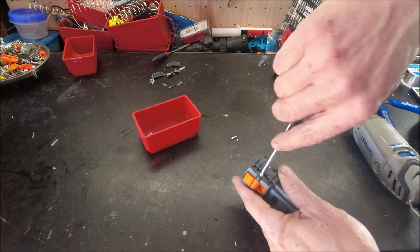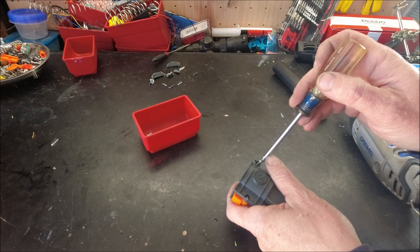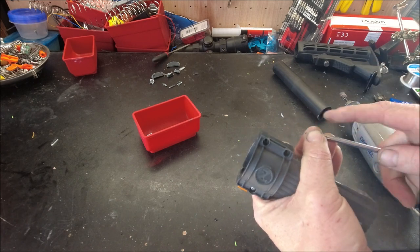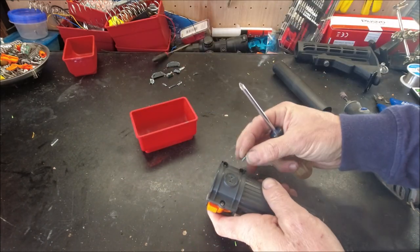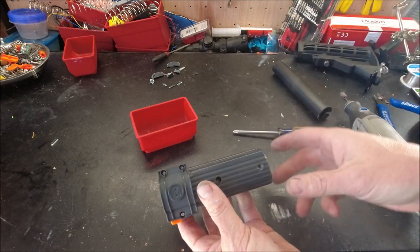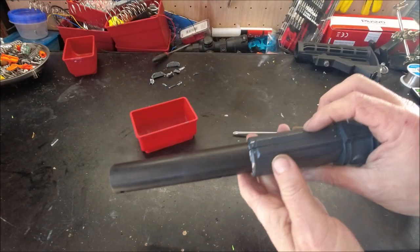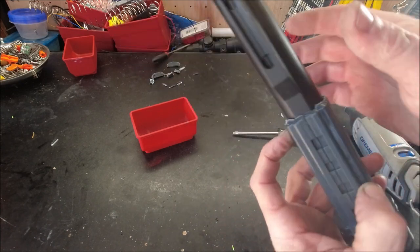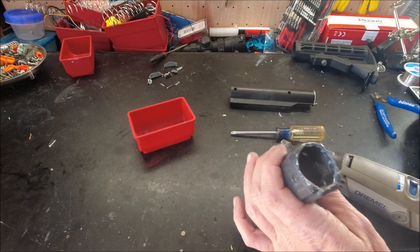And then, once this is together, guys, we'll go ahead and finish up the rear sanding till the buffer tube actually fits the hole. But I like it together and snug to do that, to get the best fit that we can get. And then we'll drill it and put a couple of screws in it, and we should be good to go. One more screw. The reason it's not all five is we cut this rear post out. And you can see you've got our hole here. And we're pretty close. I mean, it actually fits, but it is opening it up just a hair. I don't know if you can see it on my thumb, so we're just going to sand that just a little bit more. And then drive a couple of screws in it. And Bob's your uncle. So anyway, I'm going to take my Dremel and my small sanding burr, refine this just a little bit more, and see if we can't make it fit just right.